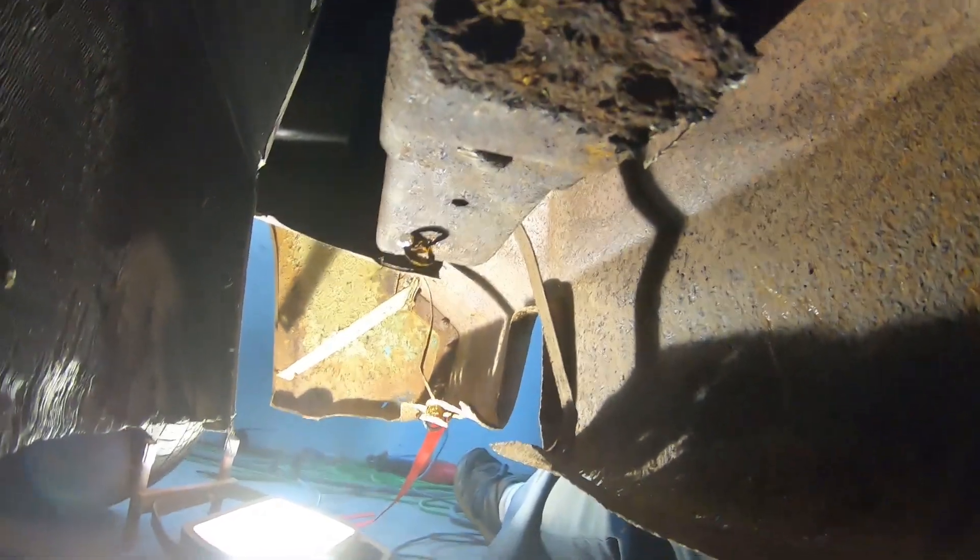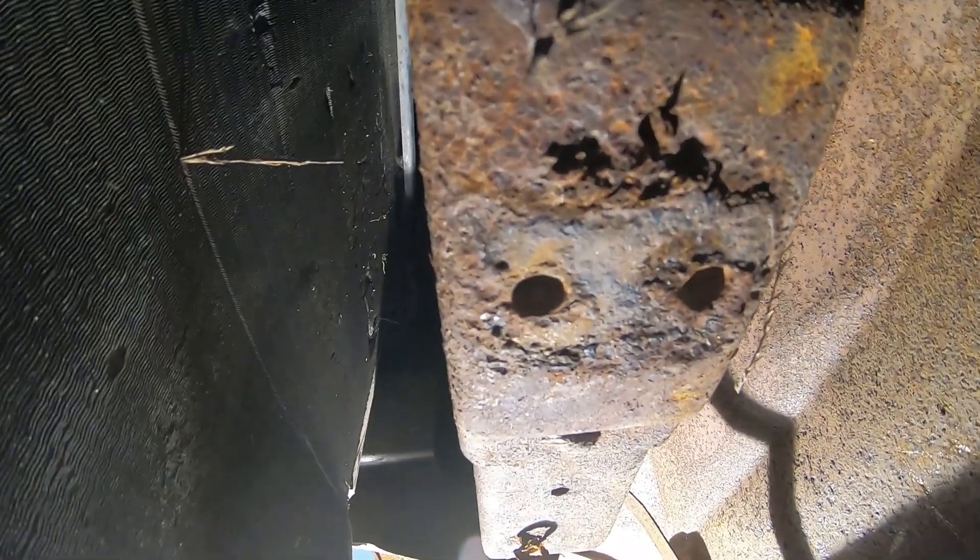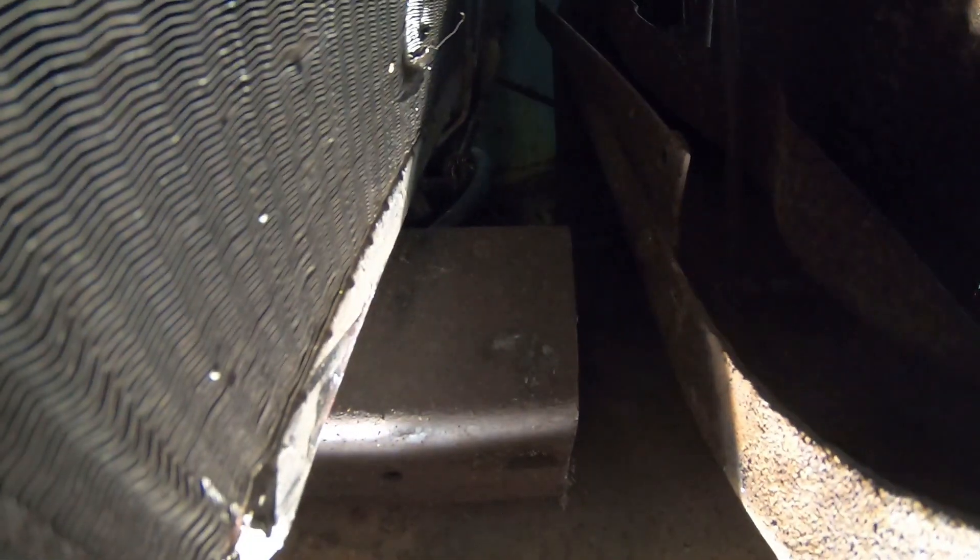Up there, that is the frame horn for the Ford Ranger. You can see exactly how much lower it sits — this being the radiator support here, and those being the two bolts with the old rubber pad there. So there I will put a piece of angle iron, a C-channel coming out, which will go up and actually weld there and get a weld over to here.